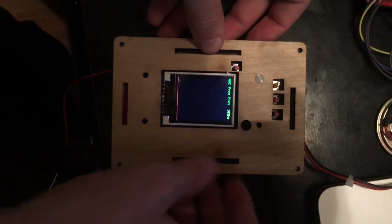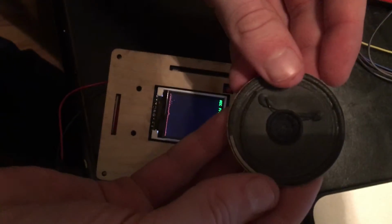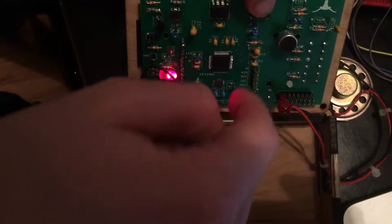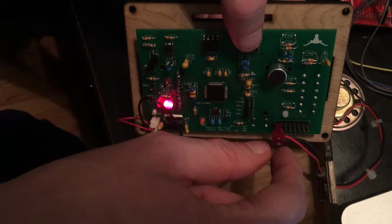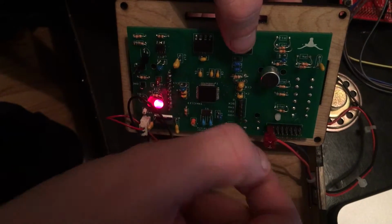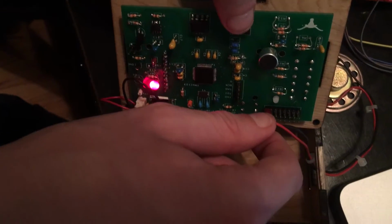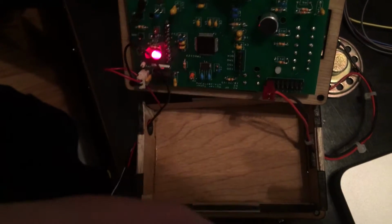Hardware-wise, we have, as I said, the LCD screen and 4 buttons, but we also, of course, have a speaker hooked up using a DAC and an audio amp over here. And then on the inside of the machine, we have a microphone set up for actually reading sound waves into the microcontroller. We have that hooked up with resistors and a low frequency audio pass filter.